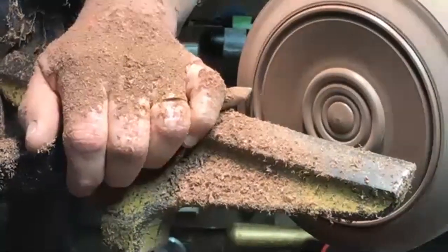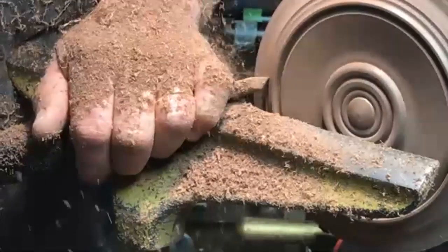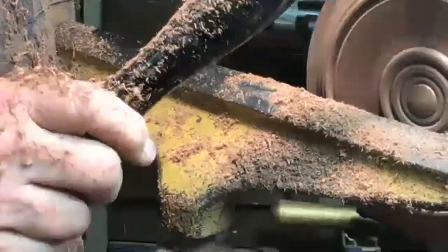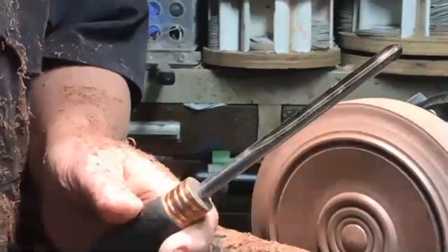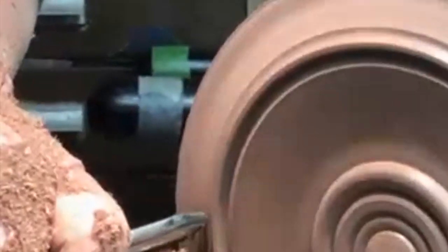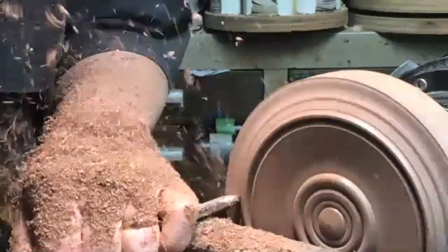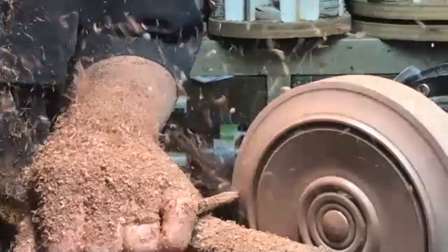I'm going to take a little off the top of this one to open up that bead a little more, then come back and cove this out some more. Now look at this tool - it has a sharp fairly pointed end. This is a D-Way and this one is a Crown. The D-Way's flute is more like a bowl gouge - I do not like it for detail spindle work, but I do love it as a small shear cutter and actually a pretty good cove cutter.